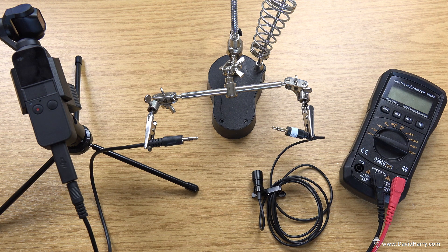So what we need to do is identify two things. One, does it supply voltage to the tip and the ring, which is left and right? And two, are they bridged or not? Now that doesn't necessarily tell us that it can do stereo, but it will tell us if they are indeed two individual channels, which is what would be required to do stereo recording.